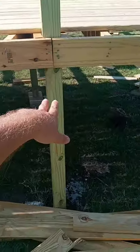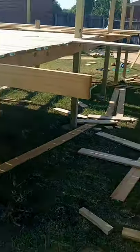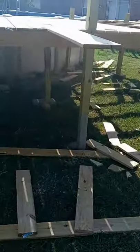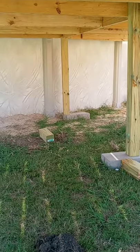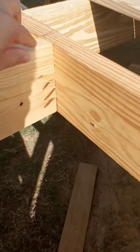Now let me say — I didn't build any of this stuff on the bottom. I didn't do any of the posts or the framing underneath. As you can see, a lot of these posts are very crooked. The guy didn't level anything — that post is barely even sitting on the block. We're going to have to go back and reinforce all of this. His joists are so bad, it's just very unprofessional — big gaps and crooked boards.